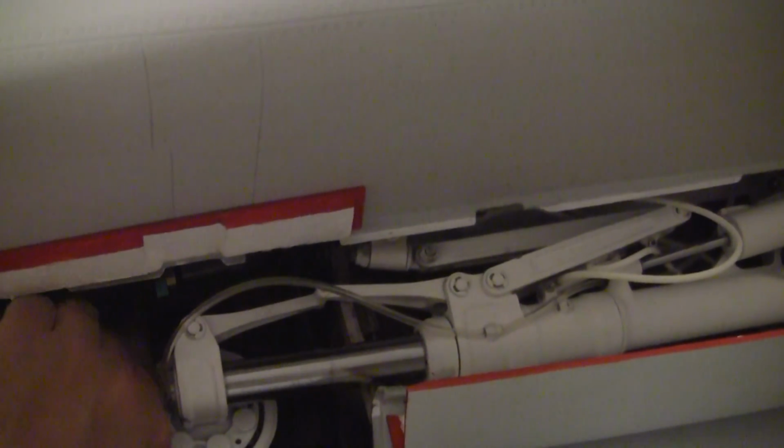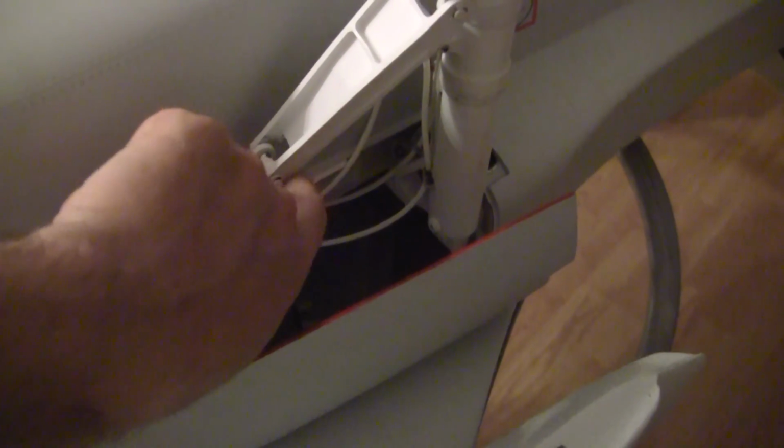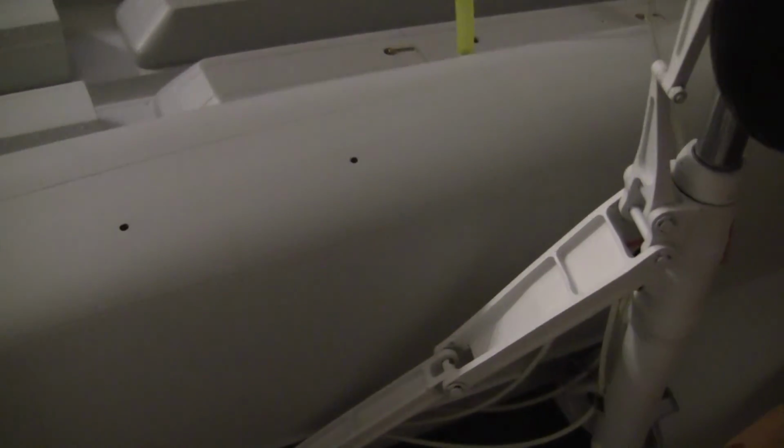Essentially, you hit the switch, you'll hear it throttle for like a second, and then it'll go full air, because as low as you can go when you turn the throttle function on is 1 second, unless there's a way to turn the up side off and leave the down on, but I haven't found it, and it doesn't say anything about it in the instructions. And then it'll start pulsing, and it'll slowly bring this thing down over a 6 second period. I did 8, but it was just too much, so I went with 6. It works out fine. From what he said, that fixes this, because you still have the wind pushing down on it, but it's that slamming force of the full air pressure that was breaking these. So hopefully that'll fix that, because every F-14 I've seen has had a gear up landing, and I'm not all about having a scratched up jet from a gear up landing.